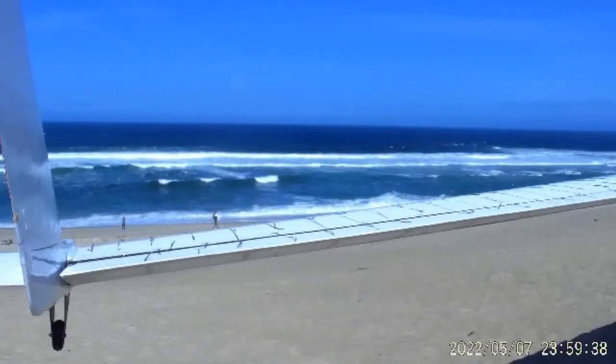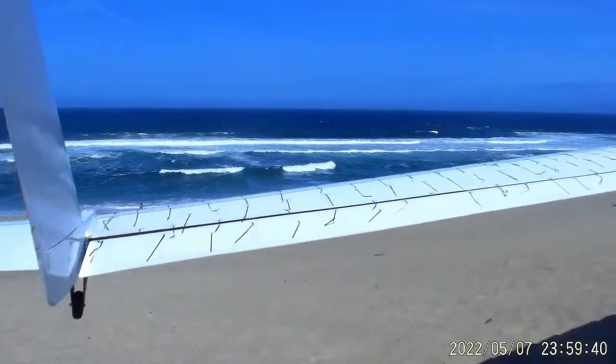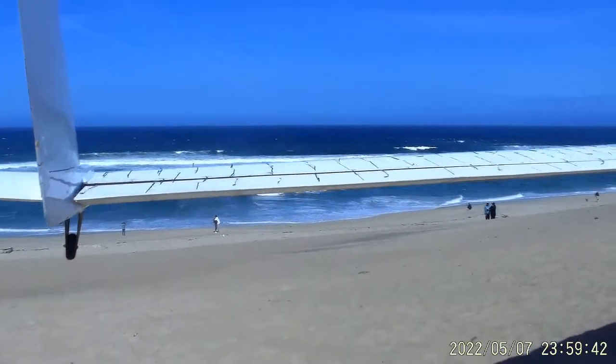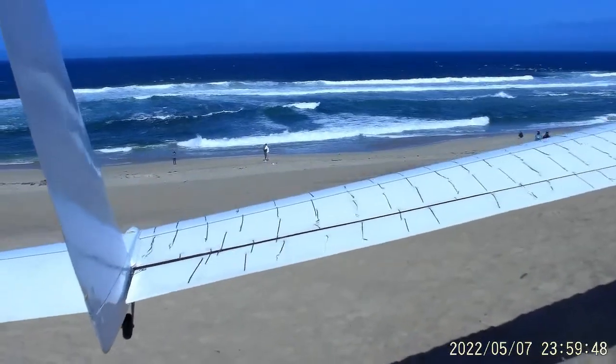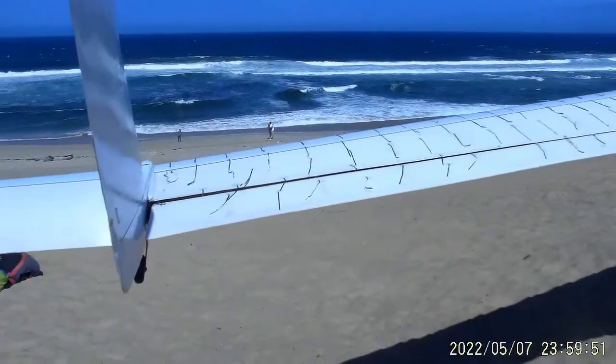Here we are still-shot at Marina Beach on May 7th. We're looking at the tufts on the left wing and testing to see if we now have the flow nice and organized over the tip of the wing and the elevon — which we do. It's working good. The new pilot's cage is working out, and if everything's okay we'll go for a couple of little test hops. Occasionally you'll see some turbulence near the winglet — that could be separated flow.